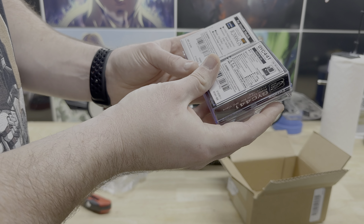Alright, this box pops open easy enough. These antennas aren't very long at all. This is supposed to be a 2.4 GHz wire, and my understanding is the exposed part is supposed to be 30 millimeters — three centimeters — but these are just 20 millimeters. Interesting. We will be popping the old receiver open carefully and swapping out those plugs for these here.